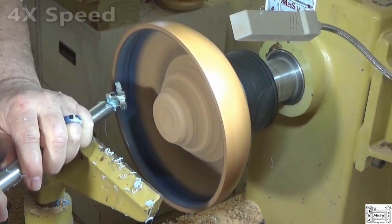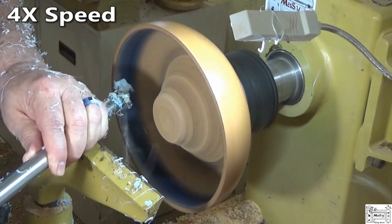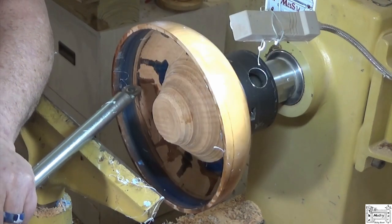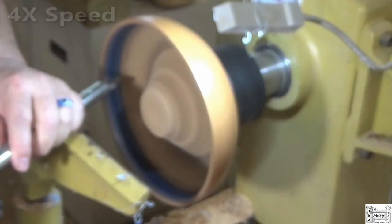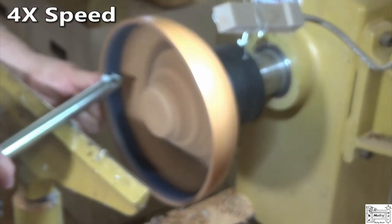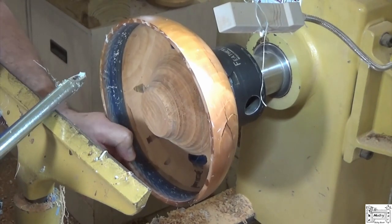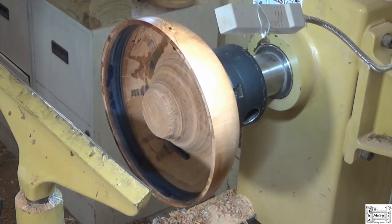This may have worked on me a little bit — we'll see. I'll switch to the round scraper and see if I can get a little better cut in there. I'm going to tilt this bar a little bit to give it a little more negative rake. This is one of the things I love about this elbow tool — its versatility. I've got some chatter going on, and some little chip-outs right there that I want to fill with colored epoxy. Let's see if we can get this thing finished up today.